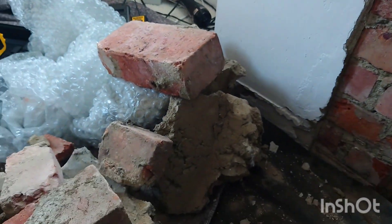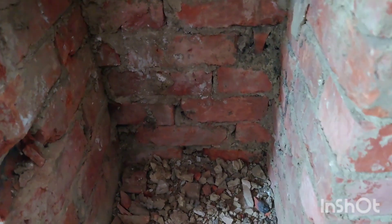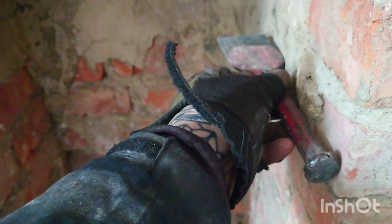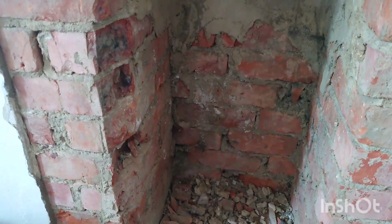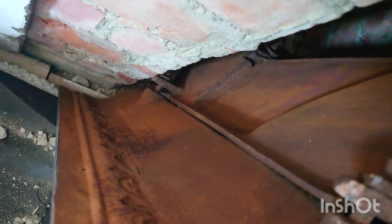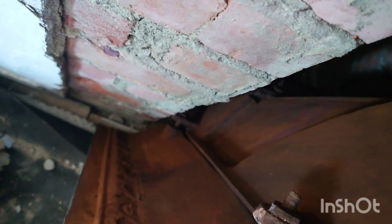The rubble was pretty loose and came out quite easy, which gives me a bit of play. I've just put the fireplace in and it doesn't go in — let me look at why. The problem is down the side here: these little brackets are just sticking out. I've just got to trim them off on both sides. You see the shape of it — we want it flush against the brickwork, so I just need to knock that bit out and then we should be sorted.